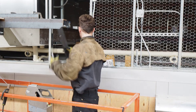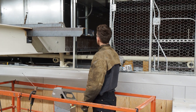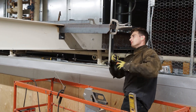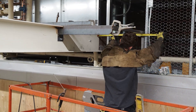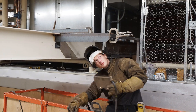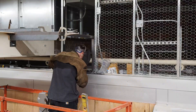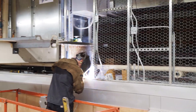On this side you're going to see me tack up the catwalk extension instead of doing the finished spot welds. I'm eyeing up the area between the two metal studs and I realize that needs to be trimmed. We're lagging down an angle piece into the subfloor and the header of the wall below me to hold down the legs of the catwalk — that's what they go into. I'm tacking on the outside leg and squaring it up with the I-beam. The I-beam is going to be my point of reference; I measure off of that and make sure that it's parallel. Now you see I'm tacking it down to that angle that is lagged down into the header of the wall.